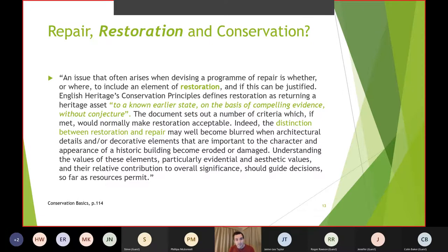We've slightly moved beyond repair to restoration. English Heritage are pushing that idea of returning it to a known earlier state — so if the sash windows of the high street only appeared in the 1900s but there were previous examples of a side-hung casement window or a mullioned window in a more medieval style, and there was good evidence of that, and the historic fabric of the sash window had deteriorated to a state requiring intervention, it would be possible to consider changing the look of the building to match a known previous state. The words are important: 'on the basis of compelling evidence, without conjecture.'